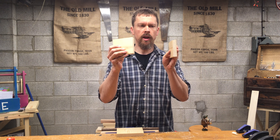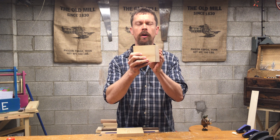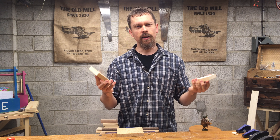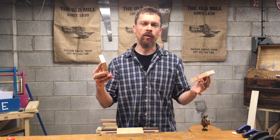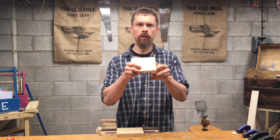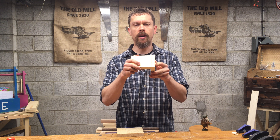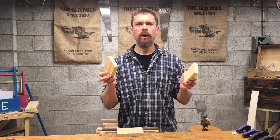In this technique we're going to take two pieces of scrap wood to illustrate and put them together like this, and that is going to make what we call a butt joint. A lot of woodworkers don't really consider this a real joint, but it is — it's called a butt joint, butting the face and the end together. It's going to be glued and nailed — in this case we're going to nail it.